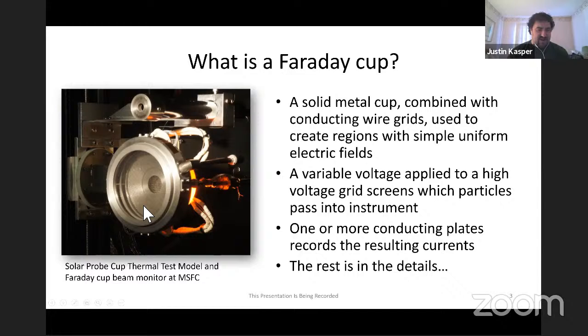One thing I like about this photo is you can stare directly into the cup. There's a whole bunch of very fine metal grids inside this opening - they're very transparent, which is important. You want them to have as high transparency as possible so as many particles as possible get through and hit your sensor for a nice strong signal. The bright orange glow in the back shows we were heating the sensing portion up to about 600 to 700 degrees Celsius, where the back of the instrument is visibly glowing orange due to the surrounding heaters.